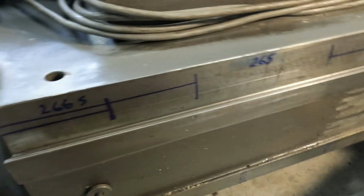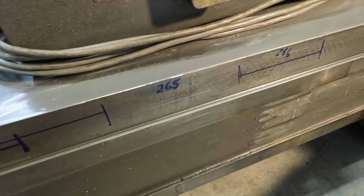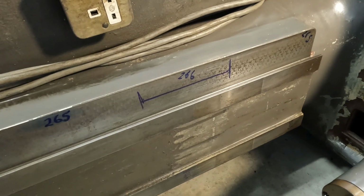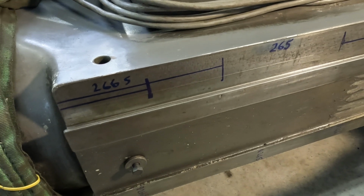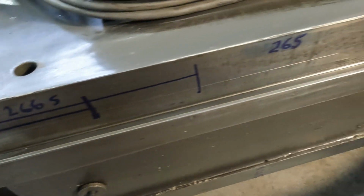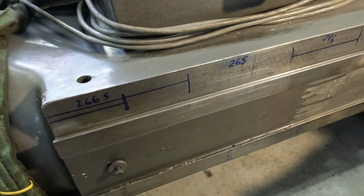Bearing in mind there's a right way and a wrong way, and the way that the person's doing it is their way, and I'm doing this my way. Any resemblance between professional scraping or shithouse scraping and my scraping is purely coincidental. So I'll get this surface here. I like to go over this, blue it up with a Sharpie, as it makes it easier. It highlights where I've been, so I'm not digging a hole. So we'll get it blued up and get you set up on the tripod.